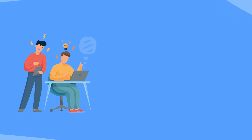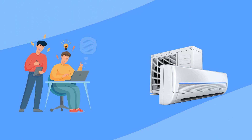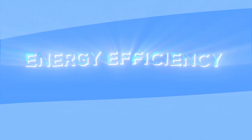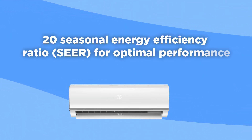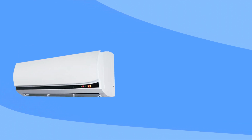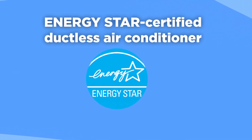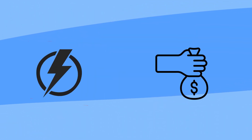When selecting a ductless mini-split air conditioner for a small space, energy efficiency is a top consideration. Units with higher SEER ratings are typically more efficient — choose mini-splits with a minimum of 20 SEER (Seasonal Energy Efficiency Ratio) for optimal performance, though options with at least 15 SEER will work for tiny spaces. Energy Star-certified ductless air conditioner systems meet EPA energy performance standards, making them energy efficient and ideal for saving on energy costs.